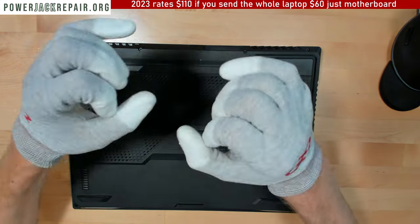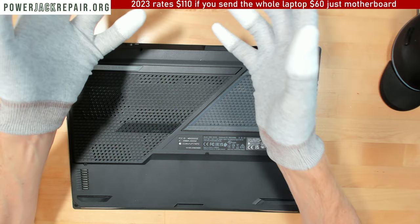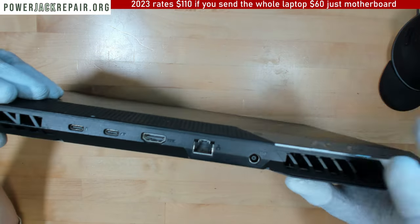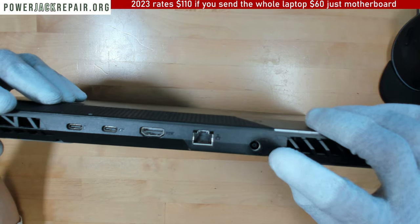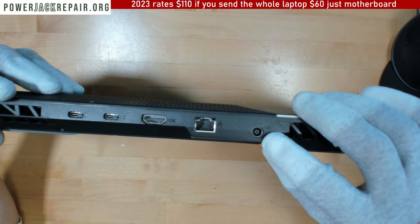I mean, yeah, if you drive a Tesla, it's gonna handle 280 watts because you just plug it in and it's supposed to, the cables are like so thick and it can handle it. The plug is thick, the connector is thick, but this is a laptop. It's not supposed to handle 280 watts. So the problem is two things. One is the connector is not able to handle 280 watts.